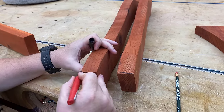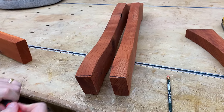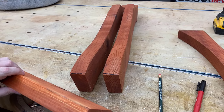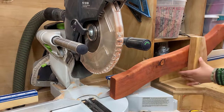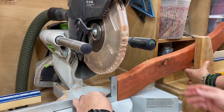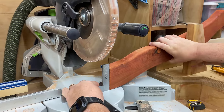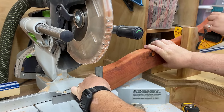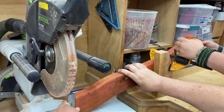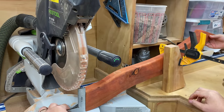I've got to do the same thing to the other side, but in the opposite direction. Once I trim those off, then when I put the board back on it, it will give us that perfect tilt in. So what I want to do is raise the leg up slowly while checking level on the saw side where it's going to be cut. And I've got a little scrap board on the right. When I get the altitude just right, I'll go ahead and clamp that leg up. And that holds the leg up at that exact height.